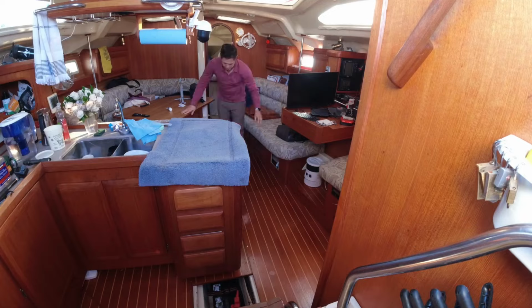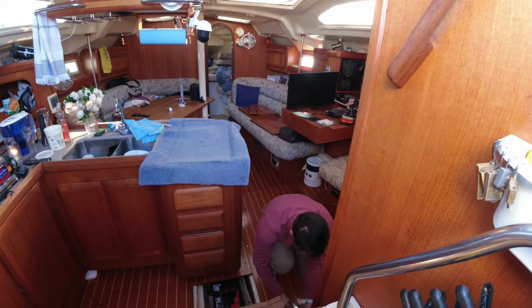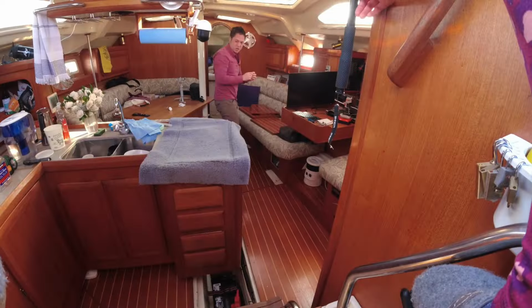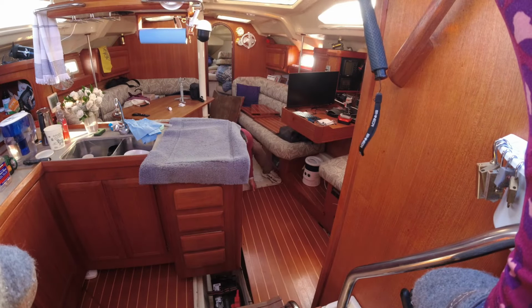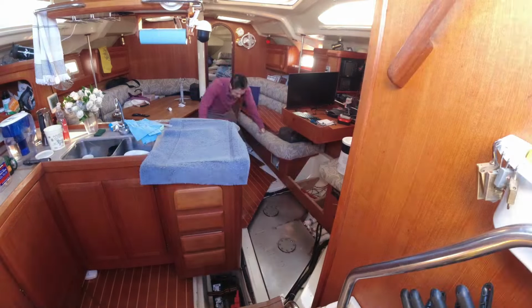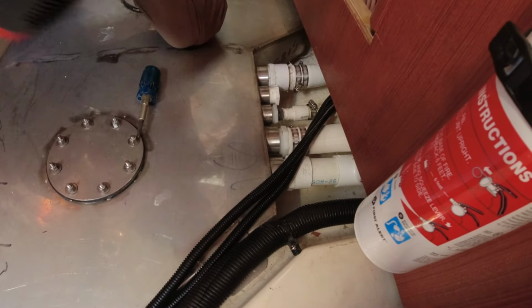Despite the fact that this is a new 316 holding tank that was replaced by the previous owner, they're still known for rotting out on these boats, and I believe that encapsulating the tank in epoxy glass will fix and prevent future leaks. So Amber came down to help with this shitty job. First, we had to get the floorboards up. A heat gun and a strap wrench helped to get the thick hoses off.